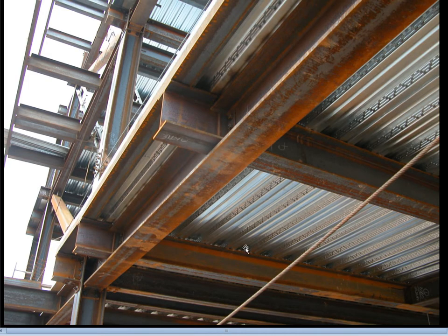Here is another view of a floor where the decking is spanning in one direction, being supported by joists. In this particular building there were many shear studs to allow composite action between the wide flange beams and the decking above. We typically do that almost anywhere we use wide flanges, because we'll be using wide flanges to get a shallower floor sandwich than we could get with open web trusses. The composite action between the beams and the floor is quite important.